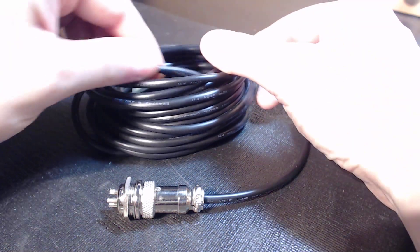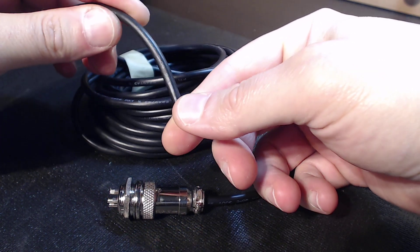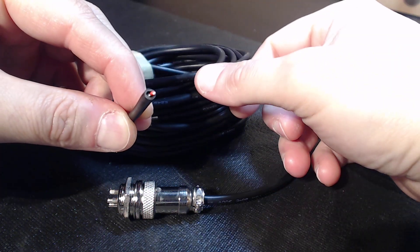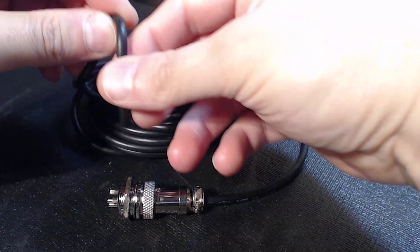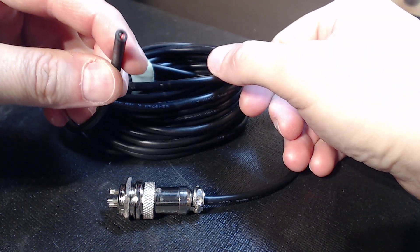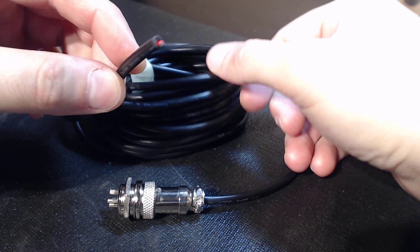First I started with the cable, and I only choose the best cables. We've got 22 AWG, 80 degrees Celsius rated, 300 volt shielded signal cable. For those not familiar with signal cable, I use it on a lot of my applications — this is pro grade stuff, it's super flexible, and this cable is double shielded.